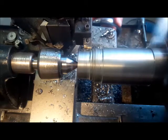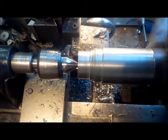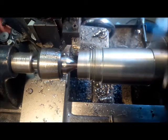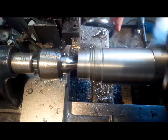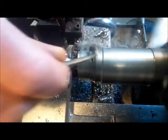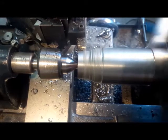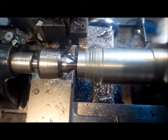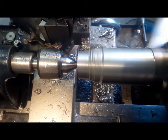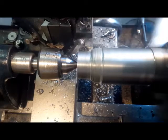There, let's try 75. I don't think we'll make it this time, but it's actually 70 thousandths — just 10 thousandths more — just by doing a little bit of tuning up the tool. And it's cutting way better because it's not just totally grinding into the work; it's actually cutting it, and it's just slowing down the lathe. Here we go, coming up on it — see if we do it. We can still do it. So 75 thousandths.